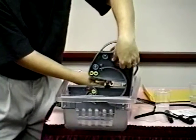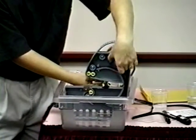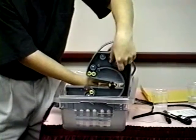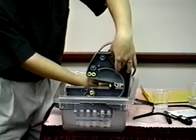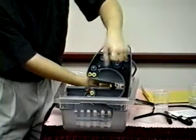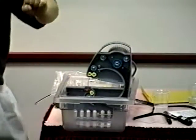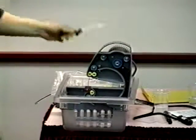We shove this thing back and we start rotating this drive gear. It was feeling like a one, like a two — real easy to turn. Now it's starting to feel like a three, a four, a five. This feels right. This thing's not flopping around; everything looks like it's right where it needs to be. Leave the wedge in there, make sure it doesn't move, then tighten the screws back down. The vast majority of these saws are going to be loosened and tightened and they'll pop right back into place.